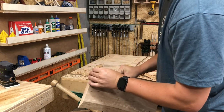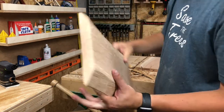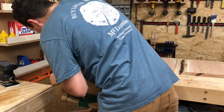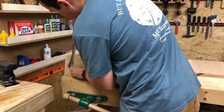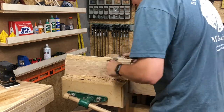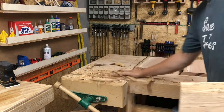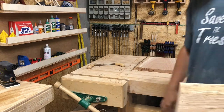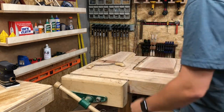You can see I'm just trying to make sure I got everything out of that piece — which clearly I did not, there's still that sapwood left. I'm going to stick that back in the vise and continue to use the draw knife to get rid of the rest of it. This can be a little bit of a challenge — you can see my left hand is really close to the workbench. Theoretically I probably should have just clamped this down flat onto the workbench with that edge hanging off, so I'd have a better position for the draw knife against that side.